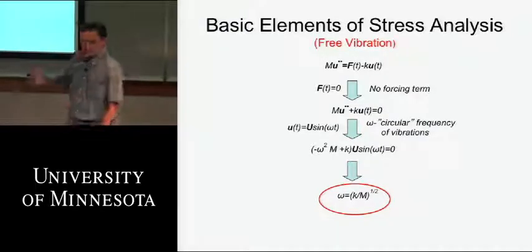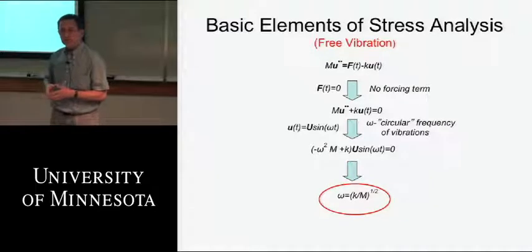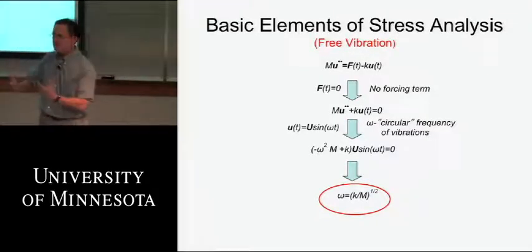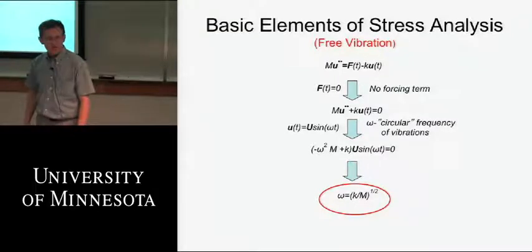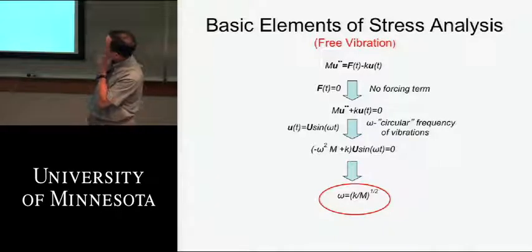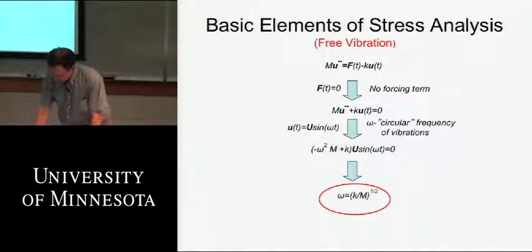One thing that we want to avoid is that a wind turbine also has certain frequencies of vibration. If the wind speed reaches a certain critical value, you may have excitation at the same frequency as the natural frequency of the structure, in which case you have so-called resonance, and there is a magnification of the deflections and the displacements, and the stresses, because stresses are related to the displacement. We need to know that in order to predict certain situations that can be devastating for a wind turbine.